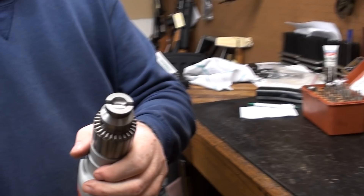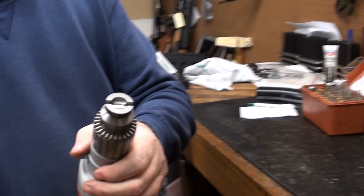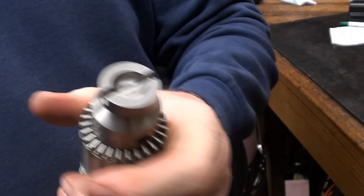This particular tool is a cup cutter. It actually puts a slight radius on the crown of the barrel on the side — it's only the exterior edge — so you don't have a sharp outer edge of the barrel.